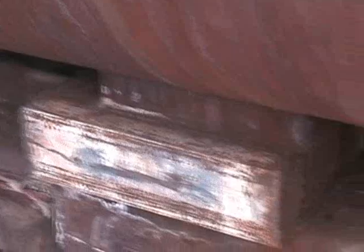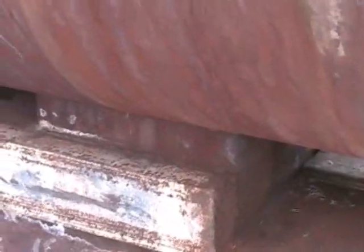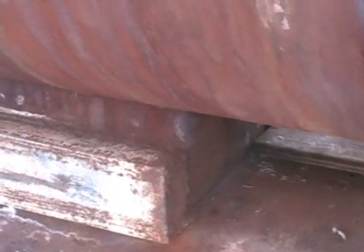That secondary air goes down inside the stove at the back. It wraps around, and there's a complex little maze of tunnels that all preheat that air before it shoots down into the jet stream there. That took a while to figure out, but got it working good.